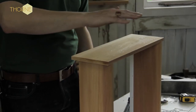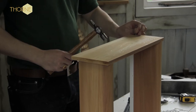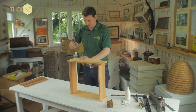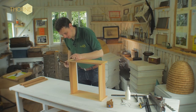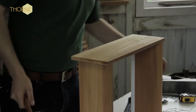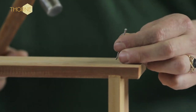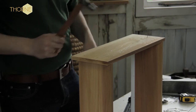So turned it over — this side is definitely right. I'm going to place this nail around about an inch and a quarter to inch and three eighths down, roughly over the centre of the groove. And the same on the other side. With the super, this is where the broods, the deep brood and the brood bodies differ — because of the depth they have more nails. For this one it's three nails each side, each wall, so you get three, six, nine, twelve nails in this one.